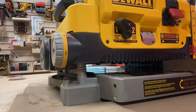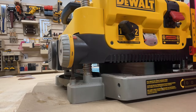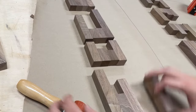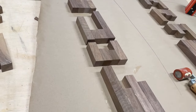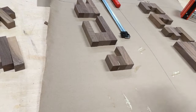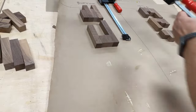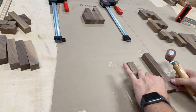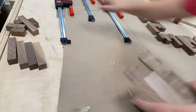To create the design, I started off by making one-inch by one-inch boards. I'm using a combination of a table saw and a planer to make this, but you could just use a table saw if you don't have a planer. I then cut those into smaller pieces ranging from two inches all the way up to seven inches, and began gluing them together in random patterns to create a little bit of artistic flair.